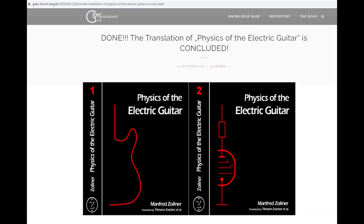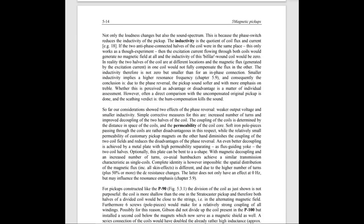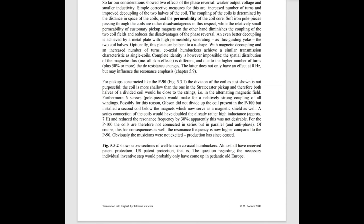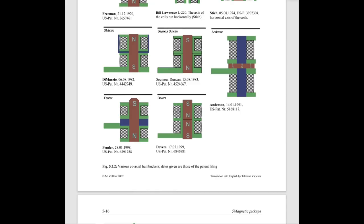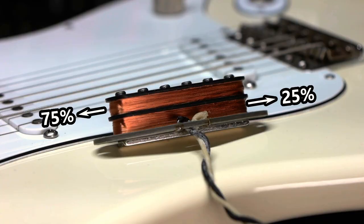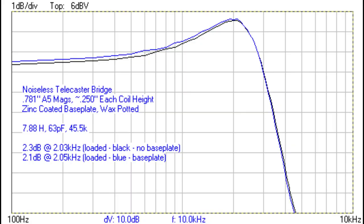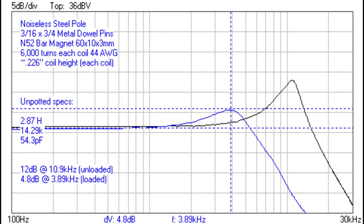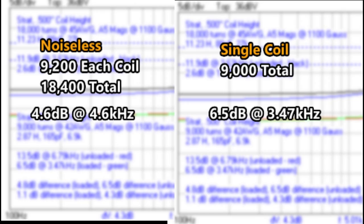The reason I go to these lengths is a bit complicated, but let me explain. The two coils need to be the same turn count to be effective at noise cancelling, just like a regular humbucker. However, in a stacked humbucker — which is what a noiseless coil is — 75% of the voltage is induced in the top coil and only 25% in the bottom coil. This discrepancy, combined with the phase cancellation between the coils, results in lower inductance and a higher resonant frequency. In layman's terms, that means for the same total turn count, a stacked noiseless pickup will have less output and more high end than a regular humbucker or a single coil pickup.